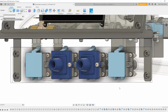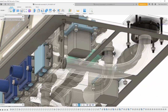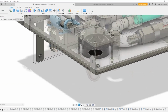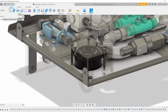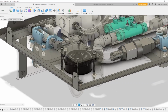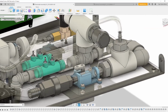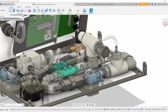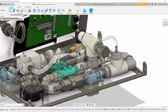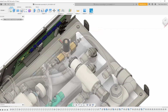Starting at the intake filter, flexible tubing routes air to the blower. The discharge air then travels through a check valve to prevent high-pressure O2 traveling back to the blower. Stepper-driven pinch valves control flow, which is then mixed with O2 in the mixing tee. The supplied O2 can be regulated through our regulator, if necessary, and is controlled by a proportional solenoid before mixing.